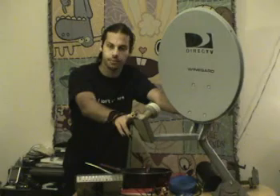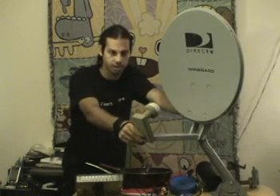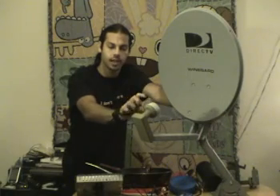If you did procure a satellite dish and you do not have an LNB, it really does not matter. Most of the time for most small-scale satellite dishes — and this would be a small dish, believe it or not — the focal point is typically 5 inches up, 4 inches in at a 60-degree angle. That is common for most 14 to 18-inch satellite dishes.